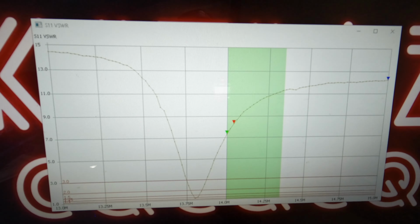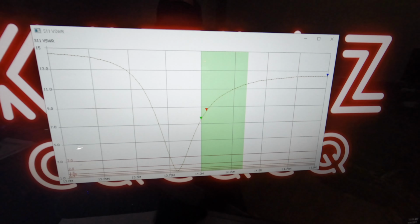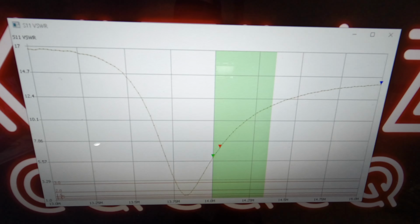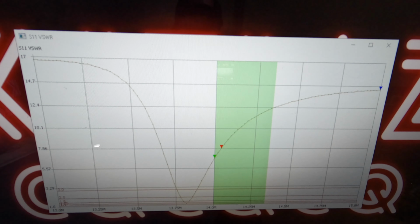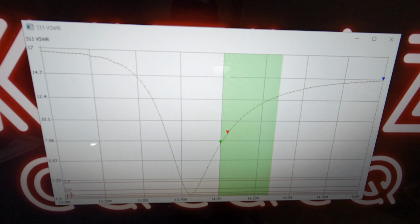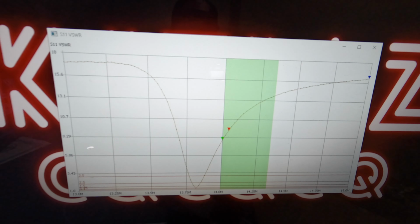and I've got it pulled up here. Hopefully that's a little easier to tell. It's like 13.8. So if you remember from earlier, anything above that frequency, it's going to show as an open. So at 14 megahertz and higher, where we're going to have our 20 meter band tuned, it will show an open. So that'll be the end of the antenna at that point, electrically. So hopefully that helps, and drop some comments if you need some clarification on that.